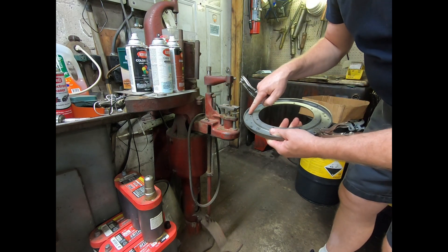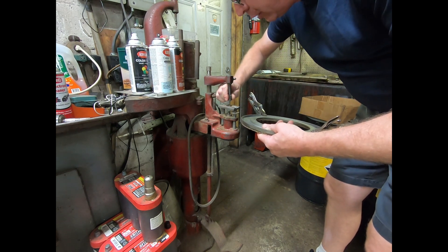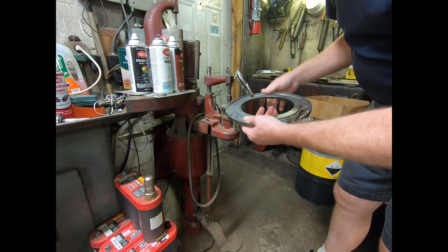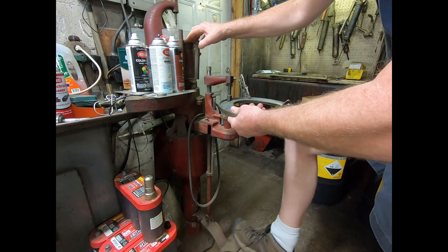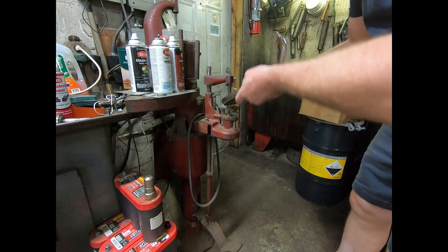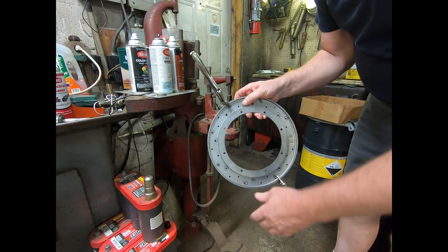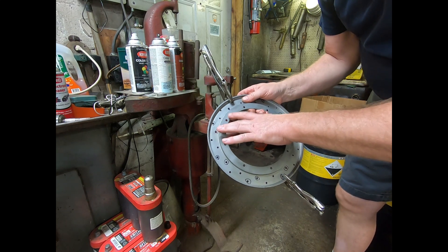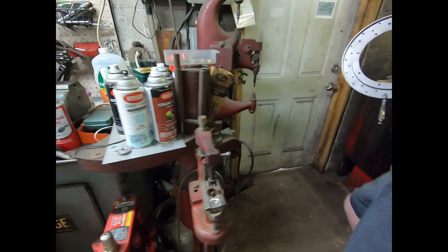Because of the shape right in here, I'm going to have to give this a rotation, because that gets in the way of the rim here. So those two look good. You'll also notice that I have two clamps, and that's just to get the process started. Now that I have these rivets in, I can take the clamps off. So now we'll move over here and set in these two rivets.